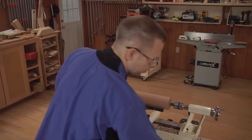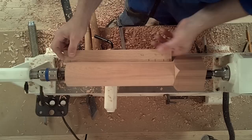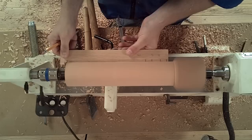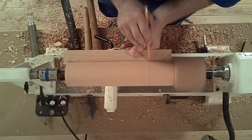I've made a story stick for the table leg that we're making today — simply a scrap block of wood with a notch cut on the end so it hooks over the end. This ensures that I get an accurate measurement off the end of the blank every time. Then I'll use my pencil at the notches I made on the band saw for each of my lines. With the piece rotating, simply hold the piece up, hook it on the end, and that ensures that the lines are the same on every piece.